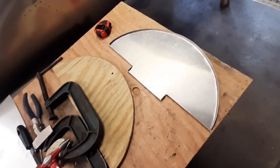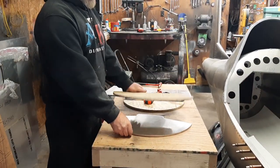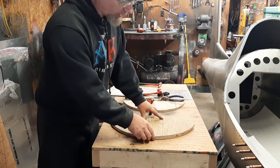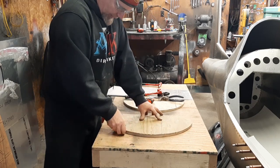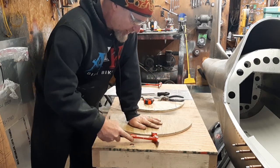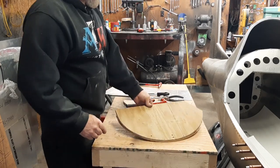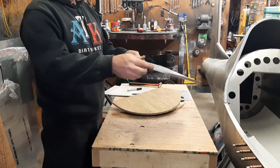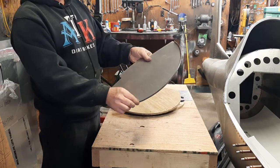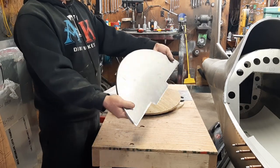Next we'll do the other end and then the bottom, which has to fit up along here for the drop center. I've got the metal form — I had this originally clamped down on the edge of the bench to start the fold. Now I'm just holding it down and working around the edge. When you're doing that it's stretching the metal, so it's expanding it and warping the panel, so I'm going to go over to the shrinker and shrink that down as I'm doing this so it'll be nice and flat once it's done.